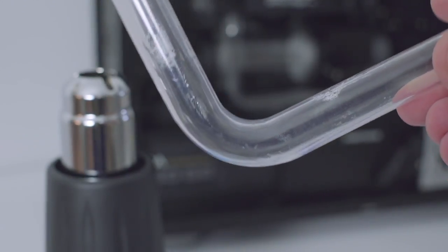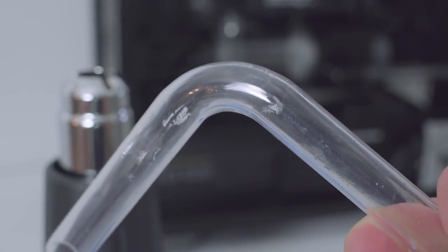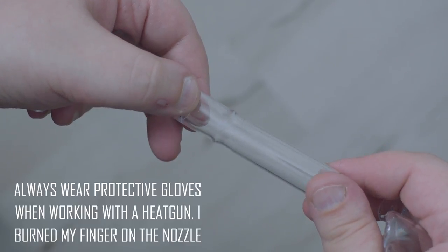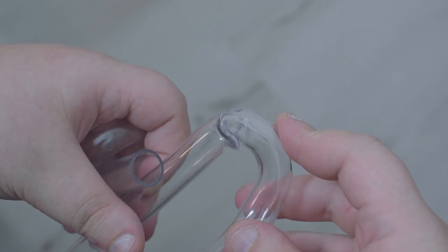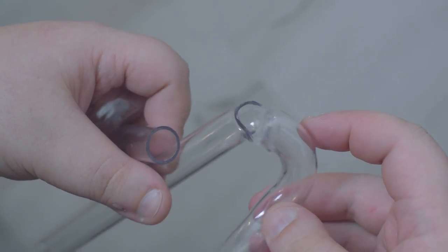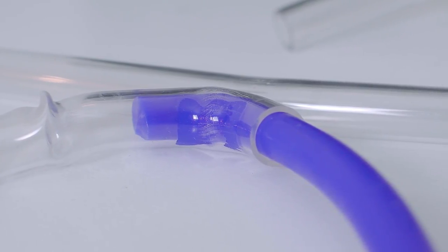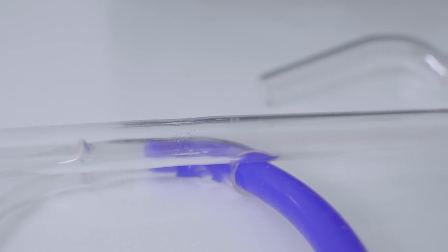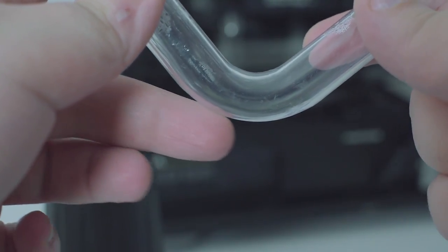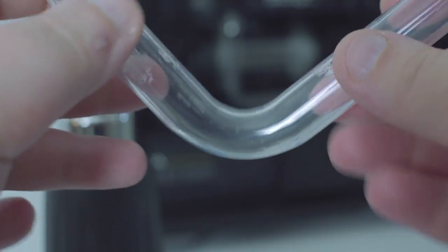You can safely dip it in water to cool and harden it. This is the bend we made earlier and as you can see it looks smooth. If you try to bend it too soon, it will bulge up and look very unsightly — it also becomes very frail and will snap fairly easily. On the other hand, if you keep it too close to the nozzle and overheat it, it starts bubbling or exhibiting striations, which is obviously not good. One thing I found is that if you move the tube to the left and right of the actual bend area, you can get a cleaner, more natural-looking external curvature.